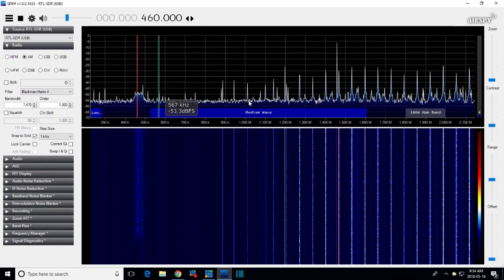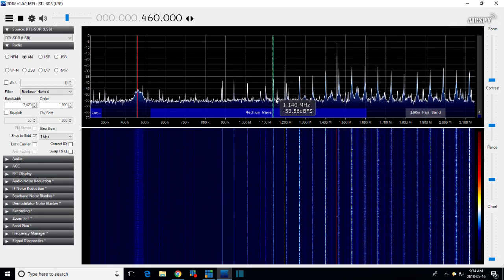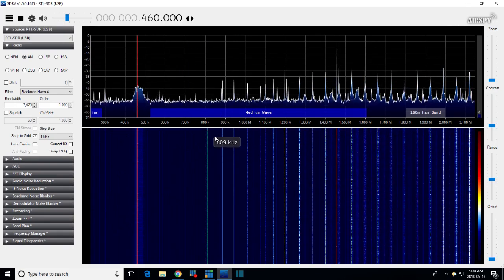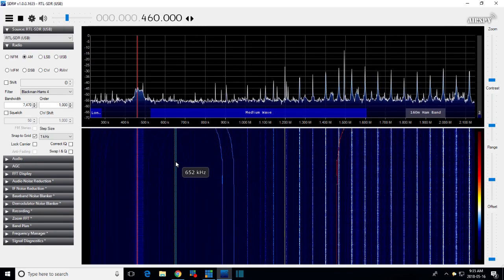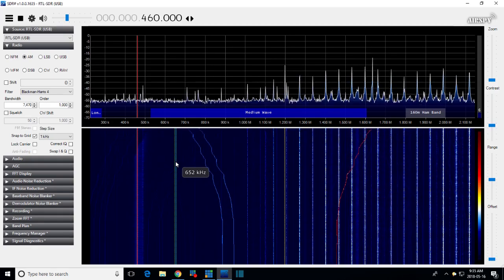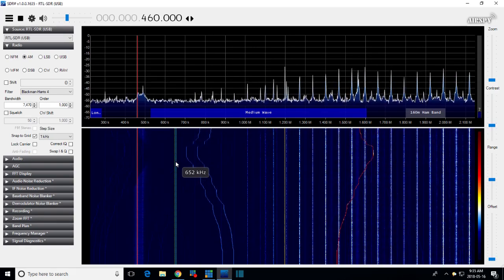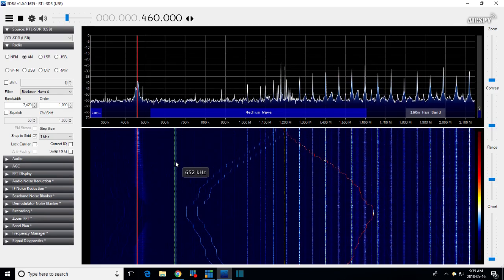It's interesting. As I tune the radio, as I move the local oscillator, the tuning window is moving around down here. Whatever it encounters in the tuning window shows up over here. Let's see if I can demonstrate that. That's really tricky to do in this arrangement. Well, let's try it. So first, I'm going to move the local oscillator and watch what's going on in the IF. You'll see stuff kind of rolling through it. Okay, so we just tuned outside of the sweep generator. That's why it went away. The demonstration's pretty crappy. Hey, look at how much bigger it's getting.